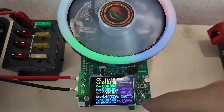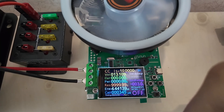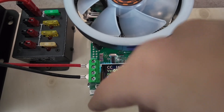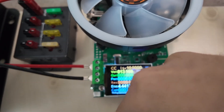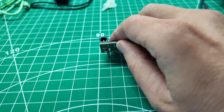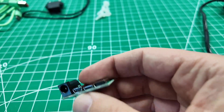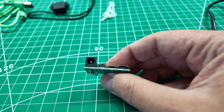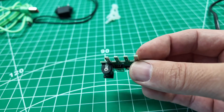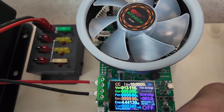You can change all of this stuff here. It has a built-in temperature sensor which will tell you the MOSFET temperature inside, so you can tell whether the fan is actually doing its job. It also has an external temperature sensor so I could actually probe the battery's temperature. Over here it can measure voltage and amperage, and each of these fork terminals are connected into two of the lugs on the terminal block. In addition to testing with bare wires, you can also shove these plated edge connectors on a printed circuit board into the terminal block, and you get a DC barrel jack, micro-USB, mini-USB, and USB-C. You can also adapt to USB-A for older devices.